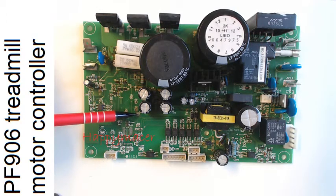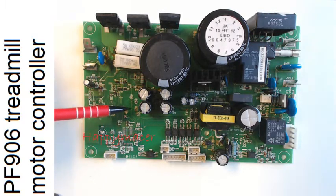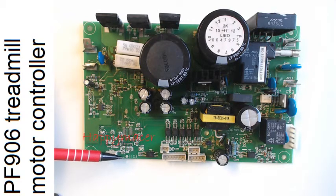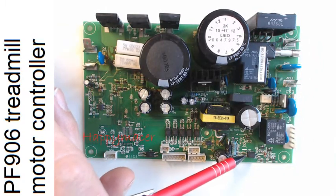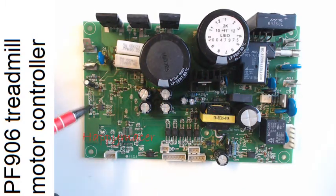So you can drive an Arduino using ground and five volts and directly input signals onto this board. The easy way is to have the PWM output drive the base of Q3 directly, and an IO logic signal to drive Q6 when you want to turn the outputs on. I want to use the Arduino to drive FR7 as well, to turn on the relay which then powers up the supply. Only after a couple of seconds do I turn on the motor, providing boot-up time for the electronics and activating the safety switches.